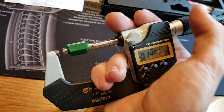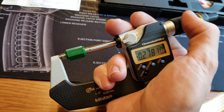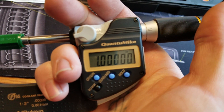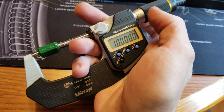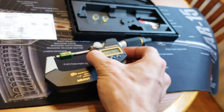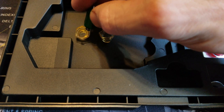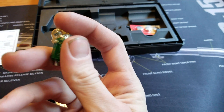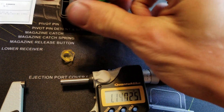In order to actually zero out the micrometer — giving it its reference zero — press origin once. It's going to ask if this is where you want your placement. Press origin again, and you have successfully zeroed out your micrometer. Now that that's done, separate the two surfaces and put these urethane covers back on your standard. It will last ten times longer and you'll thank me later.